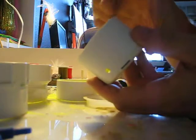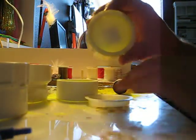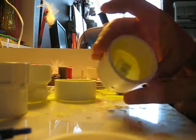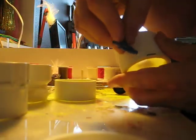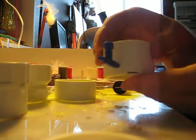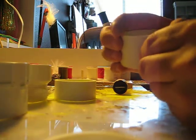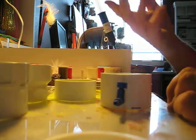You take your two inch PVC pipe — I've cut this at a length of two inches — and glued in the two inch test cap right here. Once that's glued, you drill a small hole as close to the bottom as you can, where it doesn't interfere with the cap. You insert your regulator right there, and that's going to control the flow of air to the filter, giving you either more or less lift on the paint as you need it.